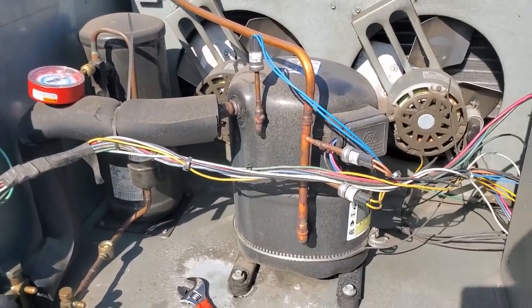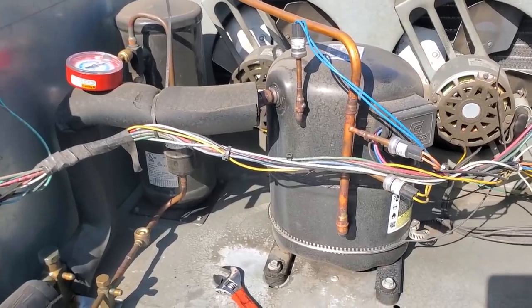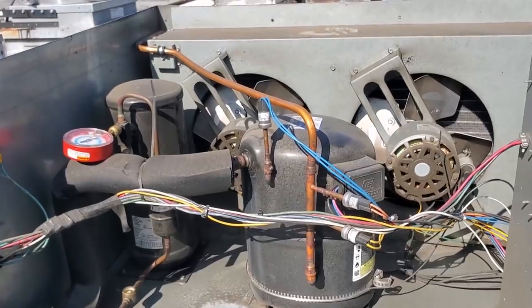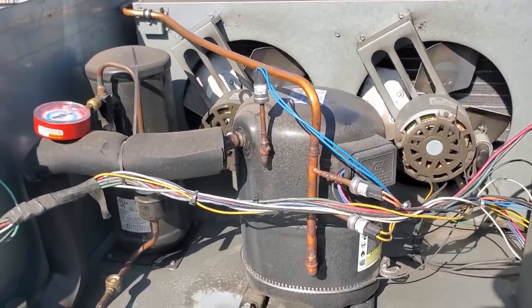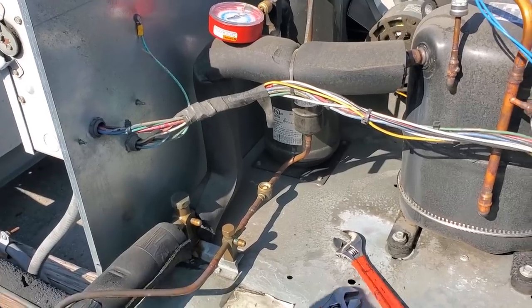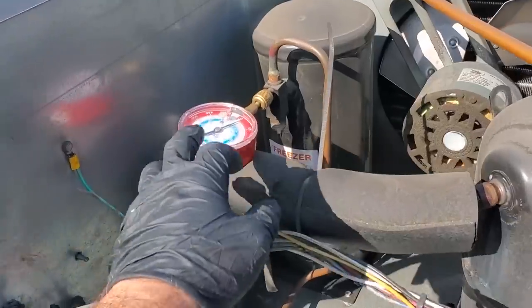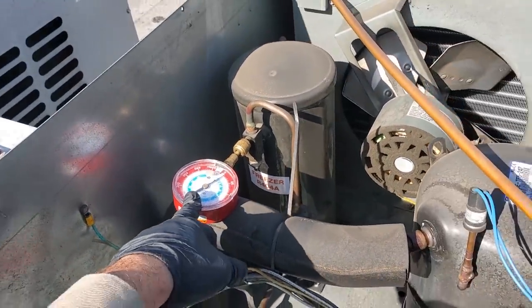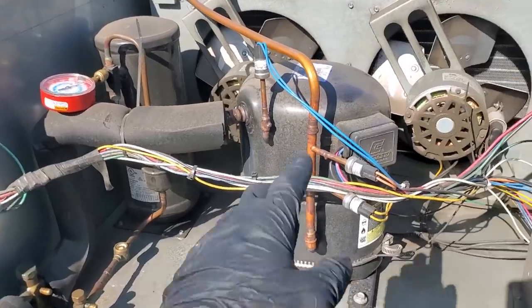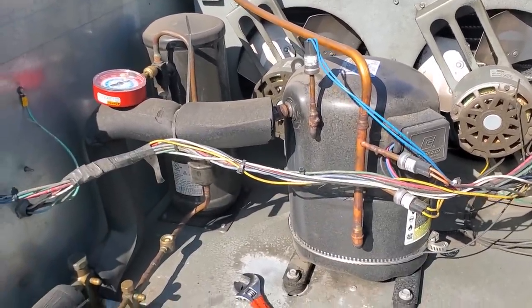Discharge pressure is very important when you're pumping a system down to find out if the system possibly is overcharged or it wasn't sized right, because there's some systems that you can't pump down. Just one of my pet peeves. I have a suction transducer or suction pressure probe downstairs on the evaporator, so I know that the suction pressure pumped down, but it's just frustrating when you can't put your high side on there and monitor the system pressures. So you would have no idea, and you would hope that the high pressure control would work if the system was overcharged and trying to pump down.